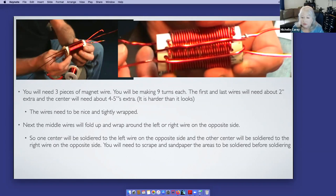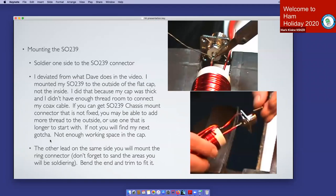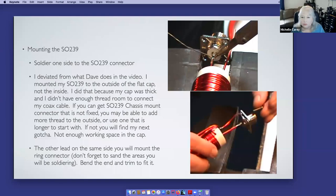Make your wires nice and tight. The middle wires: pick one middle wire, fold it up, and solder it on one side; the other folds up and you solder it on the other side. The important thing here is that magnet wire has a coating on it — you need to sand it all down before you can get a good solder joint. Barb Schluter asks: is it a 1:1 balun? Yes, it is a 1:1 balun. And on spacer spacing: it's not critical, just separate the wires and give them some distance — mine are about four to six inches apart.